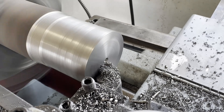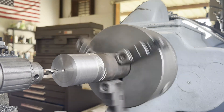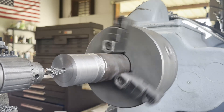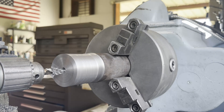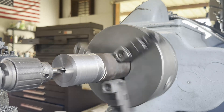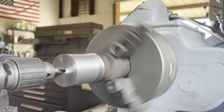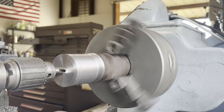I was thinking about how to solve this, and what I decided to do was use an end mill and plunge it in to give me a fresh start. It turned out I had run a like an eighth-inch drill bit into this hole at one time because it was a lot deeper than I thought - I had to plunge in about half an inch. So I used my largest live center drill, a 60-degree drill, feeding it in as far as it would go to get a taper on the outer rim of that pilot hole. I did get a taper, thankfully, revealed on the last plunge.